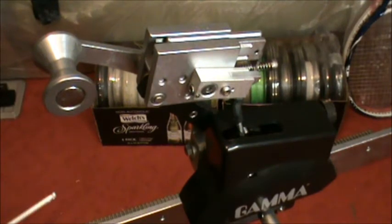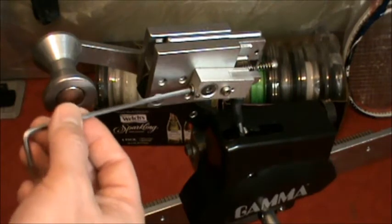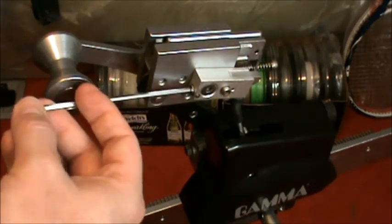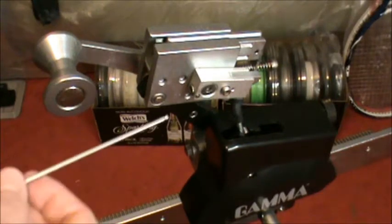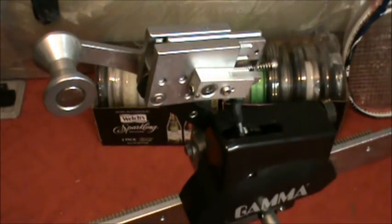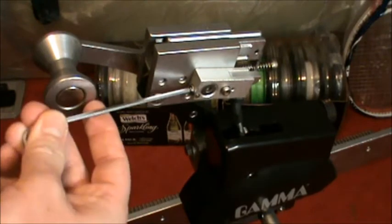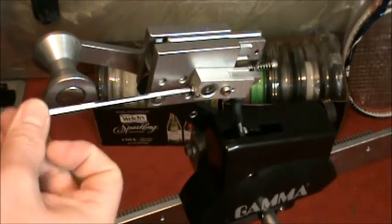There's a number of things, but if you're pulling under or pulling over what this is set at, it doesn't take much movement on this screw's part to alter your actual pulling tension. So if you've got a vast difference, let's say 15, 20 pounds, you thought you were pulling at 50 pounds, but you find out via the calibrator that you had only been pulling at 35 pounds, it's not much of a turn on this screw that could explain that. Likewise, if you thought you'd been pulling at 50 pounds and you realized that you were pulling at 65 pounds, again, maybe this screw moved just a little bit as you were moving the machine around, or maybe this set screw wasn't tight to keep this from moving around.